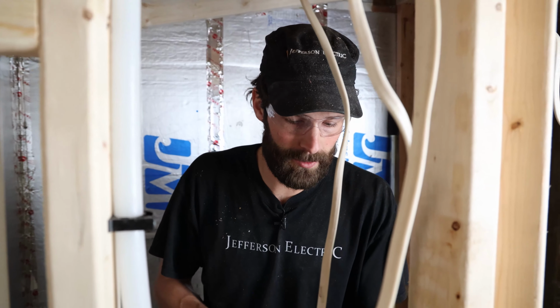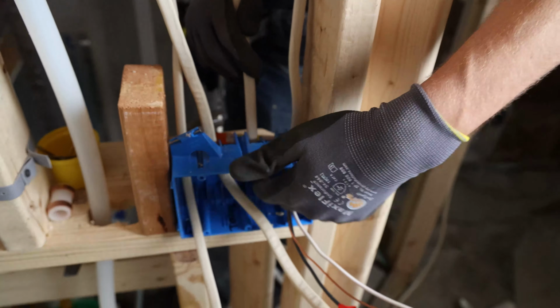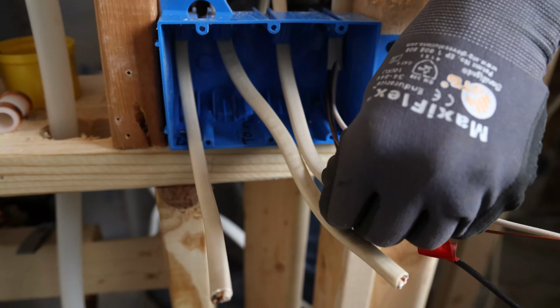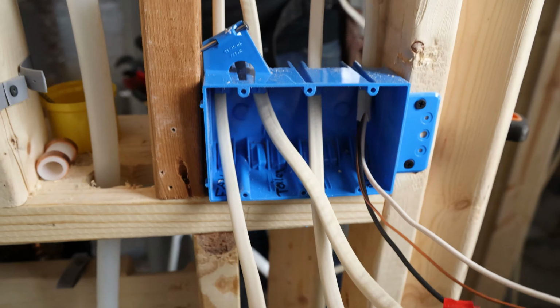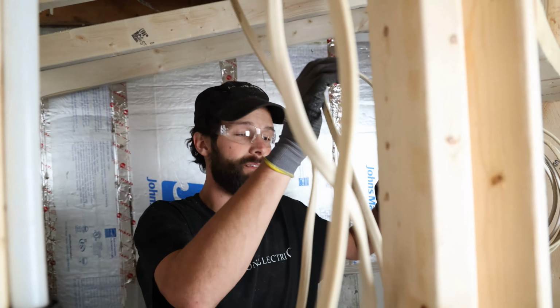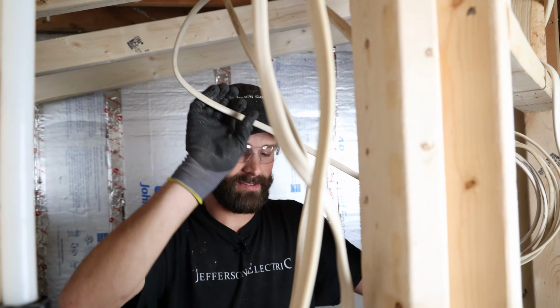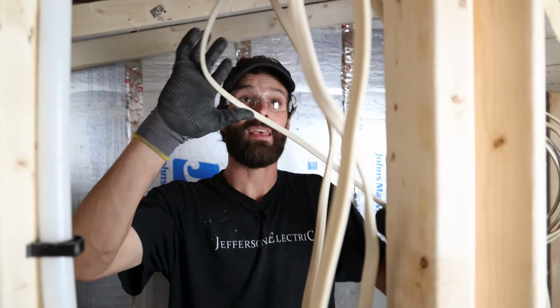All right, now we're bringing in this shower switch leg in position number 3, or 1, actually. 1 is closest to the door. There we are, 1 to 9 inches, everything matches. That's just gonna bring a little bit of additional order to our box. And in the shower, we've got wet location rated wafer lights. These were selected by the homeowner. I think it's a really nice choice.